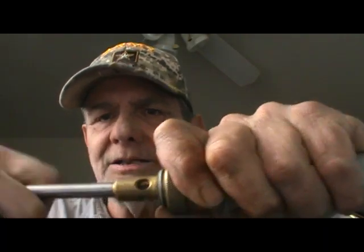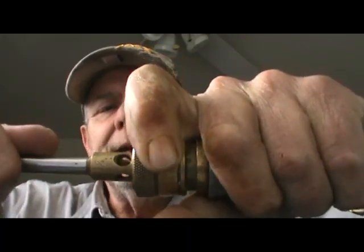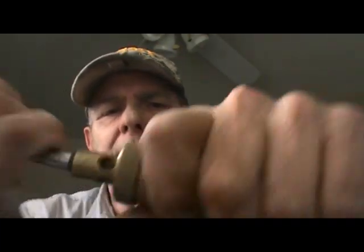It depends on the tip you're using. A8 is the proper tip. This pulls down, this pulls out. As he was saying on the video, which is really important, there is a rubber O-ring there. I sometimes lick it. It's not a good thing to do because you've got acetylene, which is caustic. And I always rub my tongue after I do that kind of stupid stuff. Anyways, when I get it kind of wet, wet your finger and then go around it, because it'll dry, and then you don't want to rip it when you're putting it in. But I always turn it and push hard and make sure, pull on it.